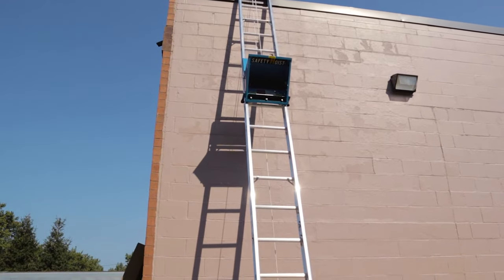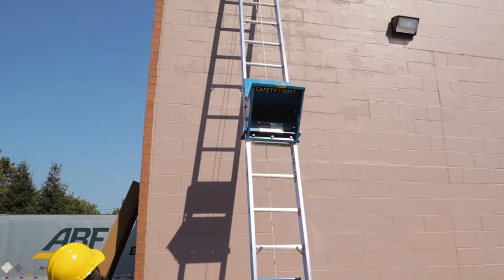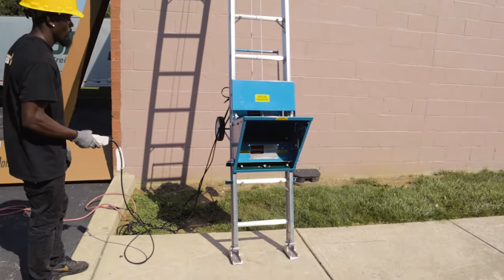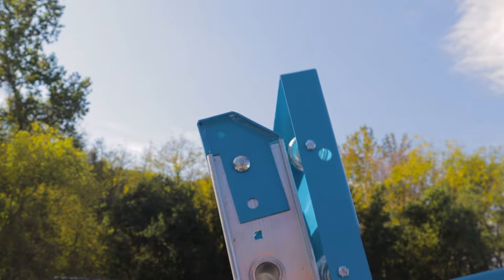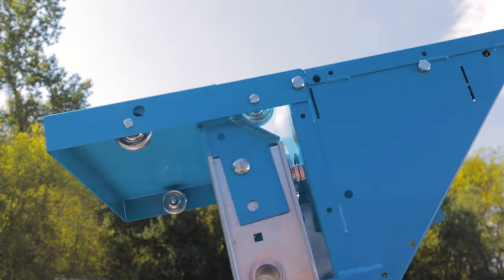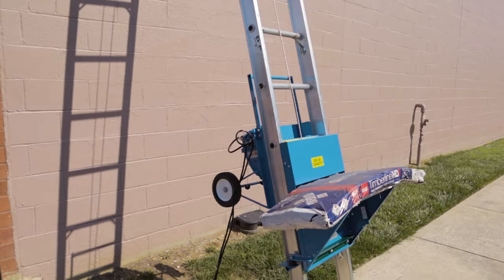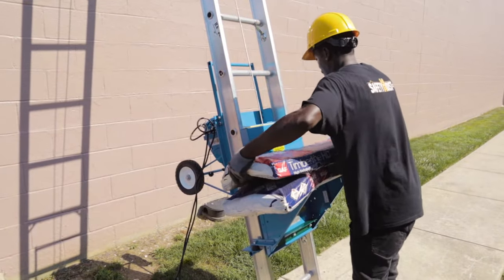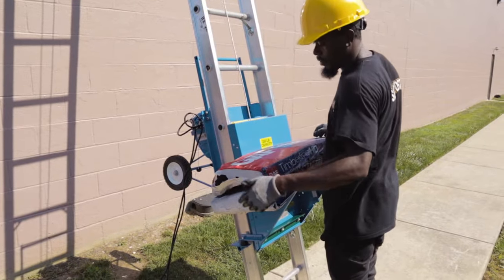Make sure you are inspecting your winch drum and inspecting your cable during each run. Crossovers must be corrected. Remove your finger when the flap folds over. This is how you will know it has reached the top. You may now begin to use your hoist. Lower it to the desired position and begin loading your supplies onto the carriage.